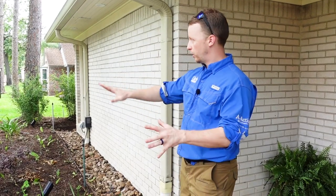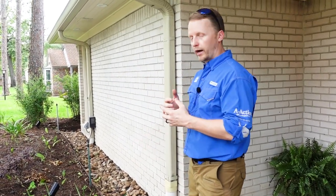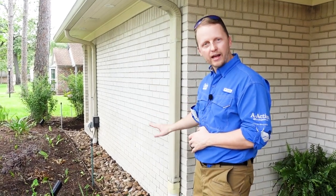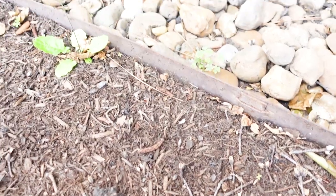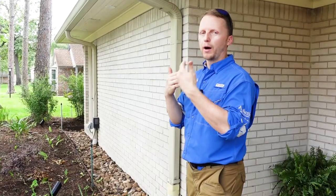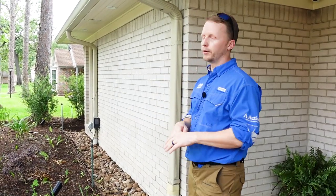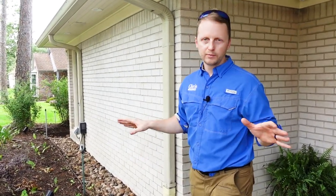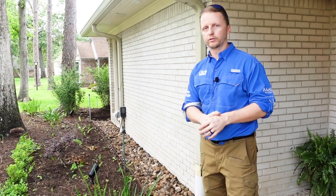This right here is really well done. Why I say it's not perfect is because the soil is right at the brick line, and whenever the soil is right at the brick line it allows possible moisture intrusion into the property. However, this home is a little older and when we were inside we didn't see any types of moisture whatsoever. So really well done on this side of the structure.